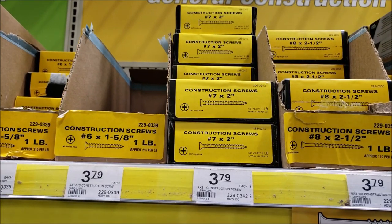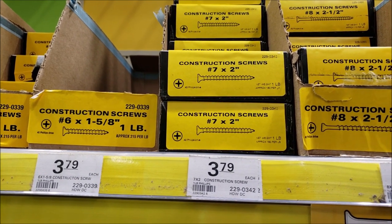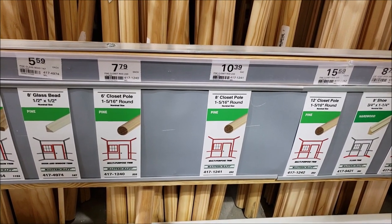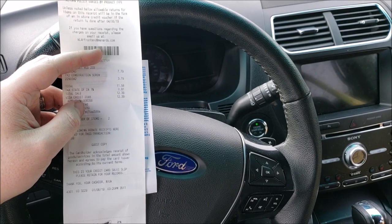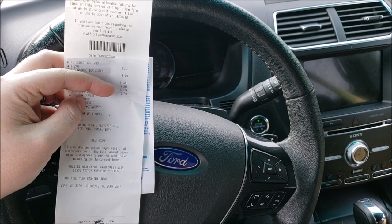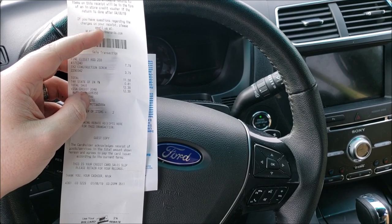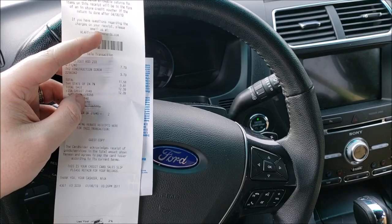I already have most of the stuff I need for the job, but I will need some construction screws — going with the two-inch number two Phillips drive. I only need to span about four feet, so we're going with this six-foot closet pole, one and five-sixteenth inch. I'm going to use scrap wood that I have for free, and I'm not even going to use all the screws I bought. For about ten bucks — or less if you have a closet bar or dowel rod lying around — that's all this project costs, as long as you have the tools like the hole saw, drill, and saws.